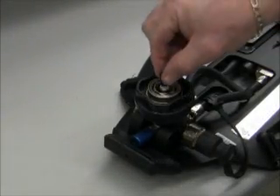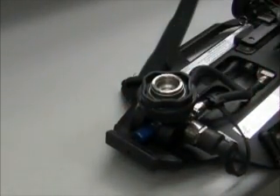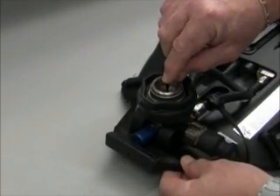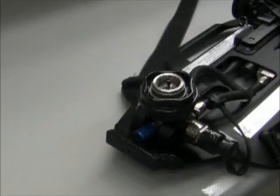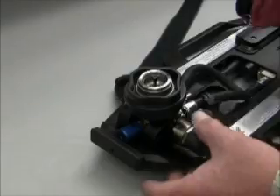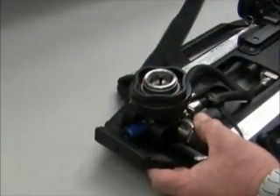Remove the blanking plug and the cylinder adapter. Set the blanking plug into the quick cylinder connector as shown. Once again, spray the 3M citrus based cleaner liberally onto the inner surfaces of the rotating section of the connector. Wait a couple of minutes, then wipe off or, using an airline, blow off the residue.